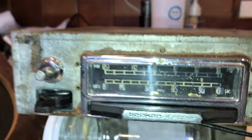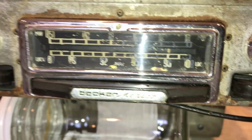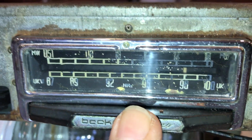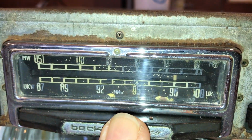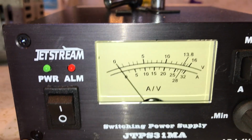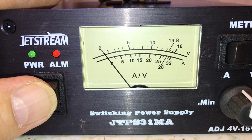And with these old radios, if they have been sitting around for a while, you've got to be careful about hitting them with full 12 volts. The problem is that there are, I forgot the term, either condensers or capacitors or something similar inside the radio, that when you hit it with 12 volts, after it's been sitting a long time, it will fry their little internals. If you use a variable power source and you power up the radio slowly, those little electronic gizmos inside will reconstitute internally, and you won't fry the radio.